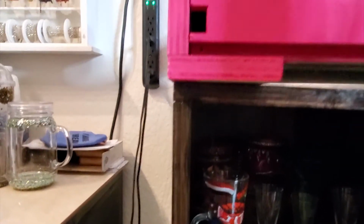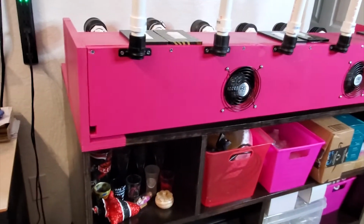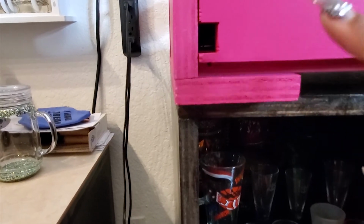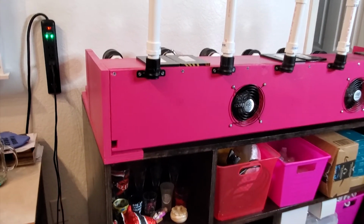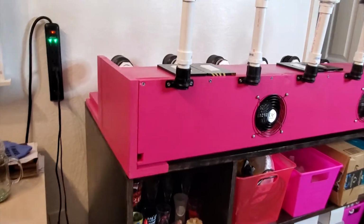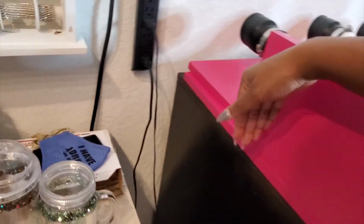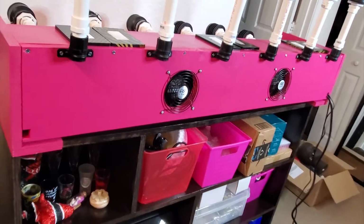And so the way this was supposed to be attached to the back is it was supposed to have wood screws at each corner, and it was just supposed to attach to the top and attach to the base that you saw. That's why that hole is there, because I had already done it, but then I had an issue, and you know, things happen. But as far as the wood screws, that is the only time that I use wood screws, except for when I attach the support to the base. So when I attach this piece, your support, to your base, I actually have 3 screws that come up from the bottom and attach the support to the base. Everything else is pocket screws.